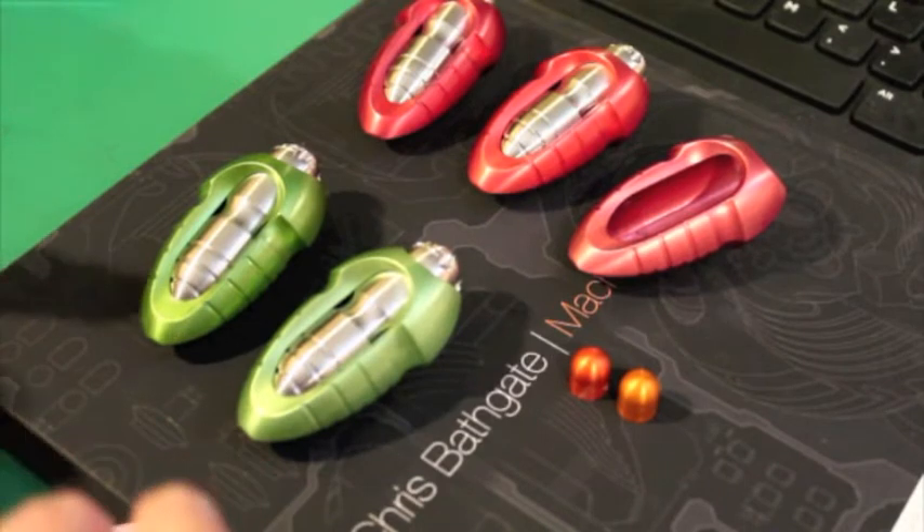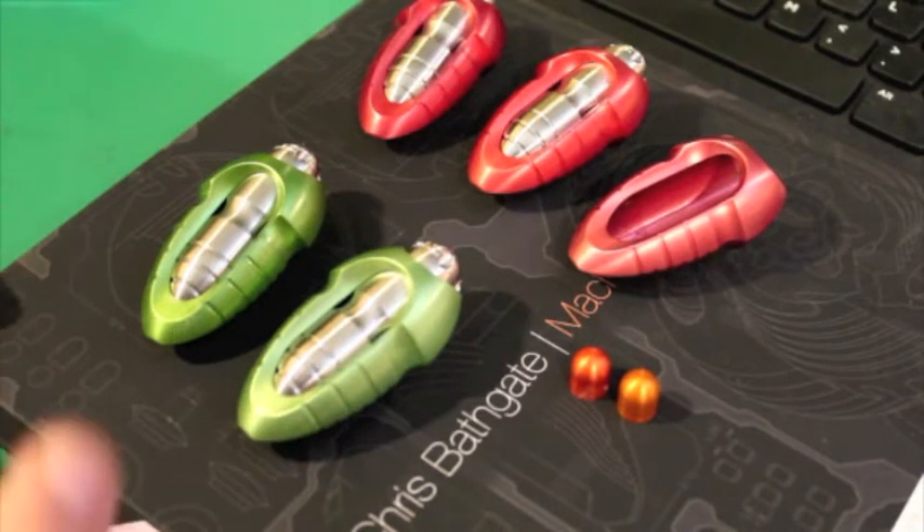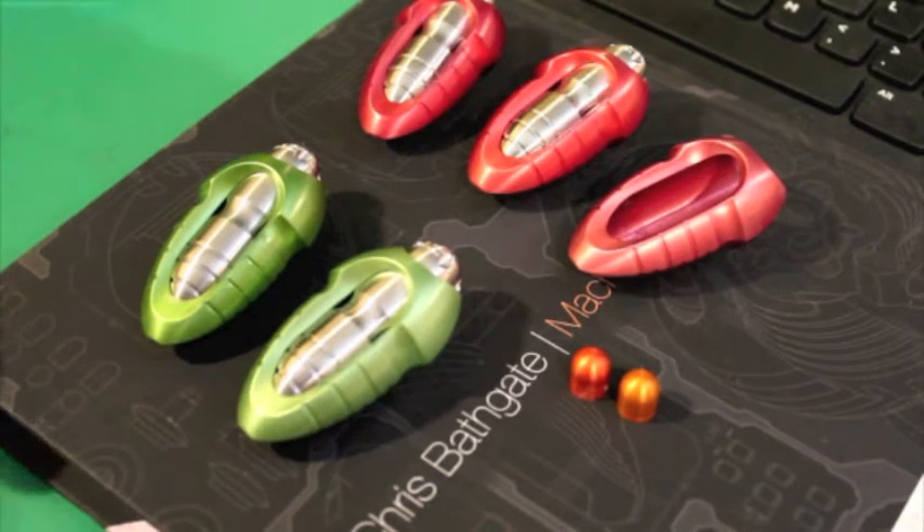I also wanted to go over what's interesting about this. I find inspiration in a lot of these technical aspects of my process. One of the things that affects the color outcome is the exact temperature of the tank — as the temperature rises, as you anodize things it creates heat and that can change the temperature of the tank. As that temperature rises, it will change the size of the pores being formed in the aluminum oxide layer, and those pores will affect the amount of dye or the shape — the amount of dye or the shape of the dye will take to the metal differently. That has a lot of impact on the final color.